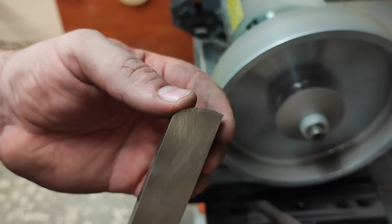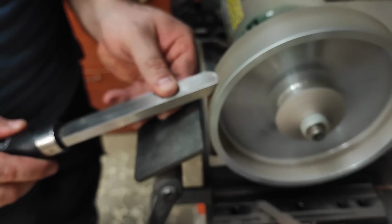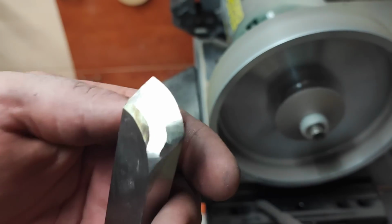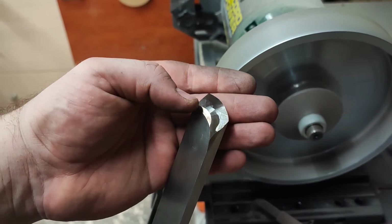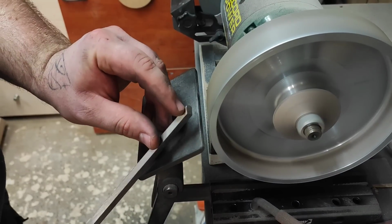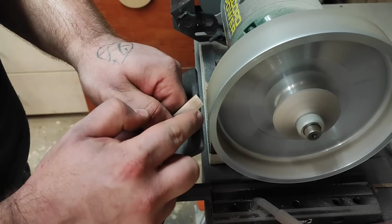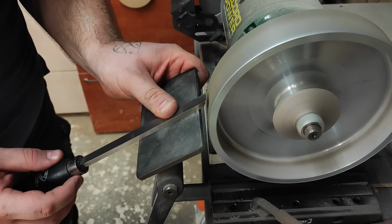And I'll do this partially freehand as well. So I find the primary bevel on the nose, again a nice burr, and I'm trying to show you the bevel here, and I can feel the burr here. It's quite nice. Got this little guy again, it's 45 degrees. Just test the angle here, and that's okay. This is just slightly curved to the right, maybe 2 degrees, something like that. So I don't go past the center here, and I just leave the handle to the right.